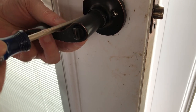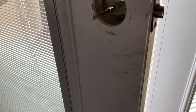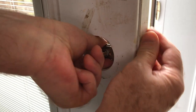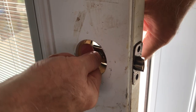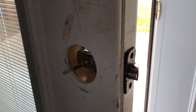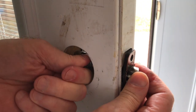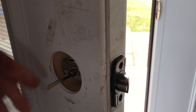I think I could have just taken a screwdriver and pried it loose, but I didn't want to damage the wood frame. Go slow — there's no reason to damage your door and turn a little problem into a much bigger one. I just started moving it around, shaking it, trying to work it loose to get that face plate to come free. I thought I could either get it off or get it into a position where I could get a wood chisel behind it. I'm not forcing it, just going easy — I did use a little screwdriver for a bit of prying, but not enough to damage the wood.